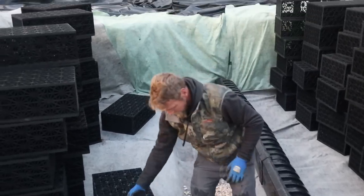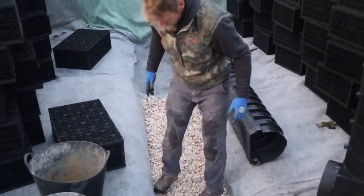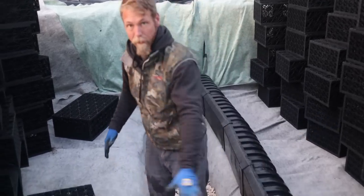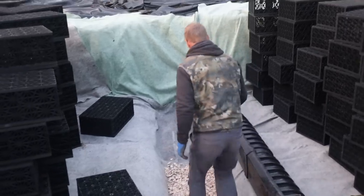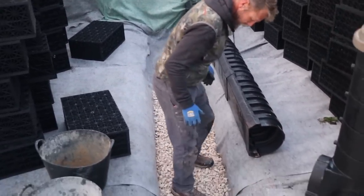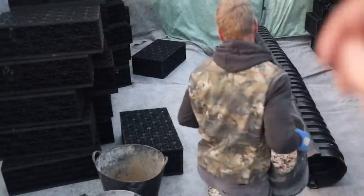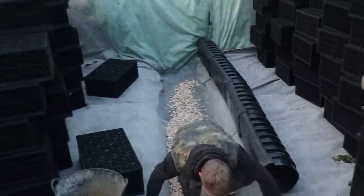It's nice having this team out here. When we have talent like this, we can split up and get two things done at once. Jack and I are working on that seam; Chris and Ralph are over here working on the wetland. Chris, what are you working on right now? Just kind of leveling up the bottom of the trench for the centipede and snorkel. We over-excavated it, brought some sand in, and now we're fine-tuning it so these aqua blocks will sit nice and level across the bottom of the entire excavation — we just have to bring that centipede up about an inch. Nearly impossible to get exact excavation because of the solid bedrock. This is just a quick trick to make sure the top of the centipedes are level with our shelf over here.